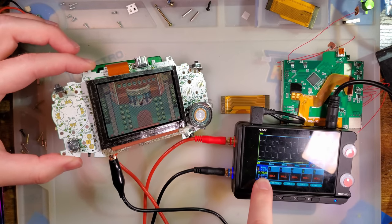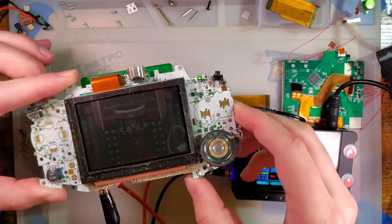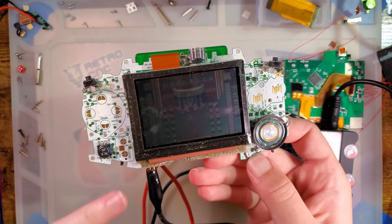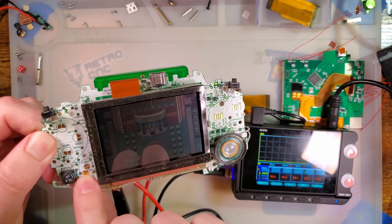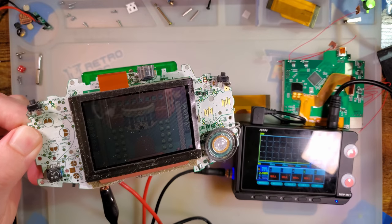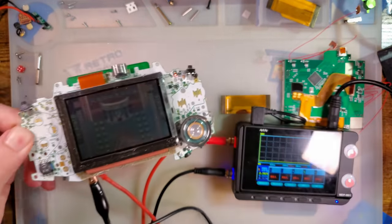So at 2.4 volts, the baseline looks like 87 milliamps, or 86 milliamps to 91 milliamps, which is pretty much average. I've said this before, I'll say it again. Basically every GBA or GB console is gonna be different. You can clean your power switch, and usually that's good for a few milliamps, especially if you get a red power light on, or like it'll flicker if you touch it, like kind of like that. This thing could probably use a clean, but it's good enough. I'm not going to worry about it. It's consistent enough, so I think it should be fine, but just for your use case.